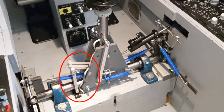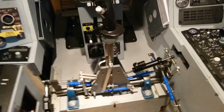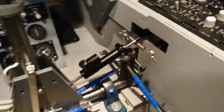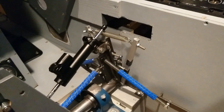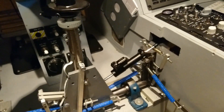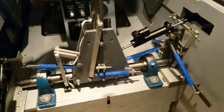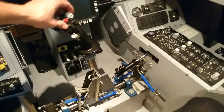I was so occupied finding a mechanical solution that I didn't think about how to integrate the electronics until the very end. The Warthog just uses one hall sensor for both axes, so I had to come up with a device mimicking the original movement of the stick. That's the new stick installed in the simulator. It certainly didn't turn out to be the sleekest piece of art, but it works as intended, and most of it will be hidden beneath the seat anyway.